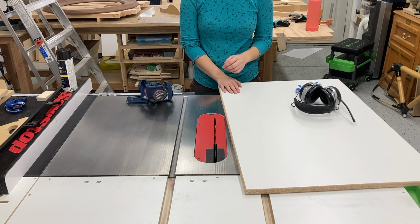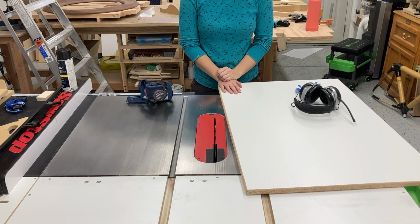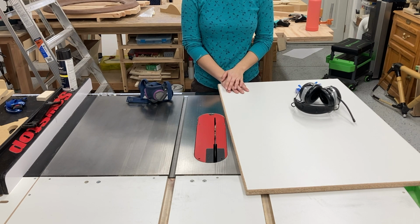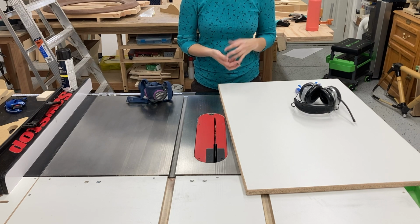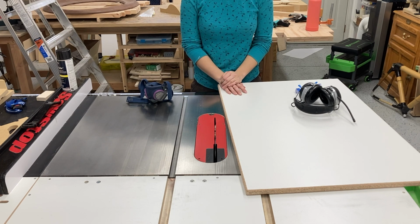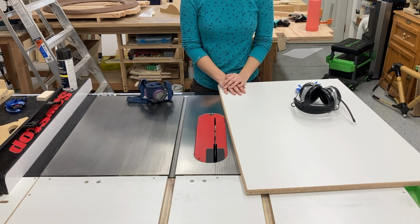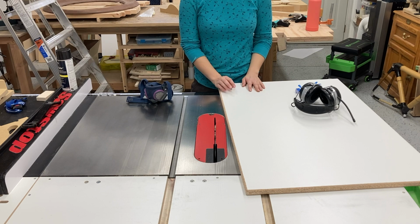I'll just put in just the mold, and instead of using a platen to evacuate the air from the bag, I'll use this special plastic netting that does the same thing as a platen does, just creates air channels to pull air out of the vacuum bag. But another great alternative, if you're using a more shallow mold that doesn't take up too much space height-wise, is to just make a custom size platen.